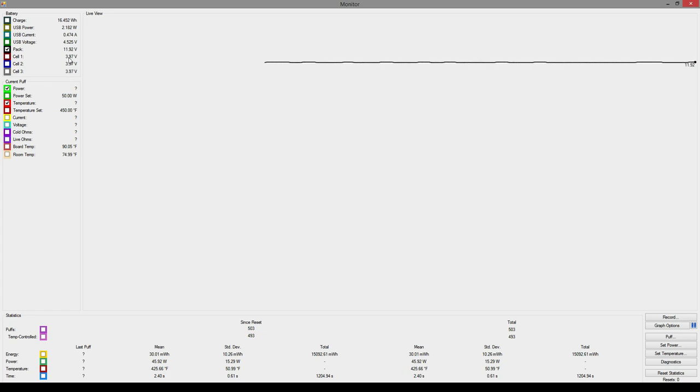You will see, and I have spent some time looking at this, just watching it charge. It charges one cell, then another cell, then another cell. It just goes through 0.1 volt every time. And it just keeps going through until we reach the maximum charge. You can see there the amount of current it's drawing from my USB connector. It is capable of drawing 1 amp. Now, it seems my laptop is only capable of outputting half an amp, so that's why you're seeing that. But this is what most people are going to be interested in, so let's do this.